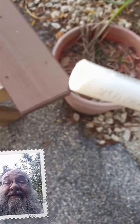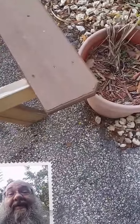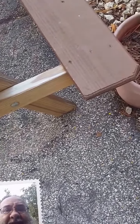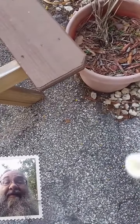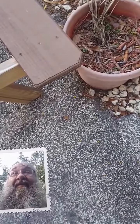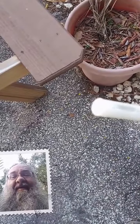On the other end I originally had a plug. I drilled three little holes in the end of it to give a spray pattern, thinking maybe I could break up whatever was blocking the exit. That didn't work. I had a stainless steel clamp holding the plug in because it was PEX and just slid in and out. When I shoved that into the tank and worked it in and out, I noticed clumps of hair coming out — that's why I'm saying hair was the problem.